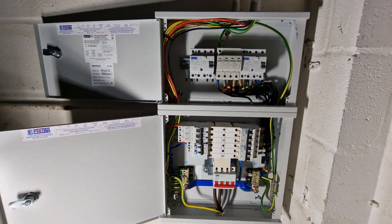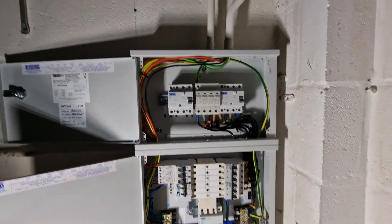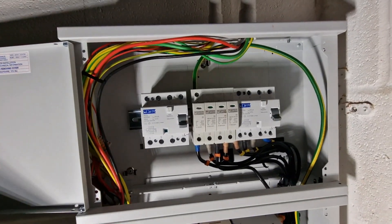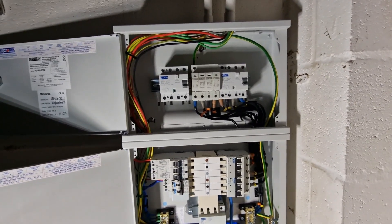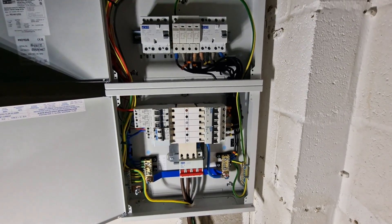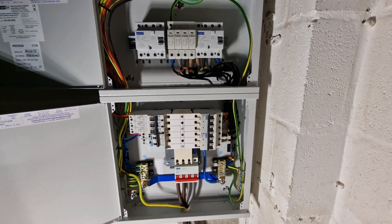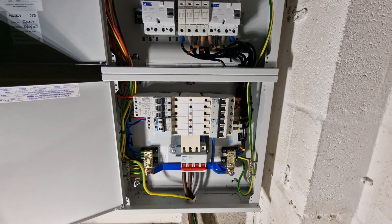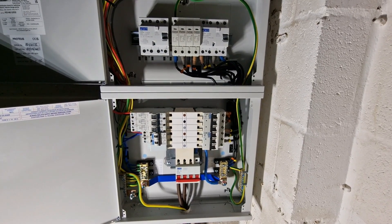We're still by torchlight at the moment but the board is getting to the stage where it's dressed away. We've got the tubes dropping in the bottom and the side, and I've brought the final circuits down the left hand side just to keep them away from the cabling that runs up to the top row which was for the RCDs. I've popped the SPD in there, so we've now got a C40 MCB leading up to that. I'm not sure if that's the right setup for this Proteus board so it might end up getting adjusted, but it worked for getting in there for the time being. We're quite close to the intake so the cabling up to it is short enough — I'm pretty happy with that as a temporary measure. We've got an SPD and I didn't have a blanking piece so I've just dropped in a little stuffer for now. I've dropped in two new lives for L1 and L2 and the meter man just needs to swap out the neutral and L3 that were in that meter already.